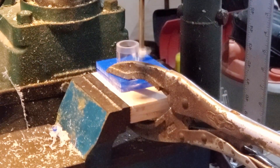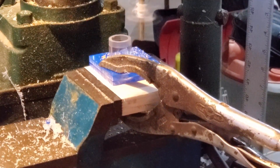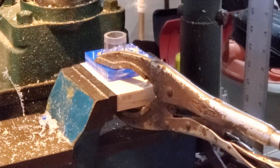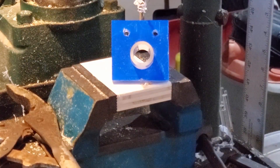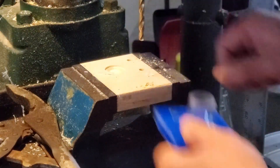To start off, I'm going to drill two quarter-inch holes to hold these two pieces together — this is where the pipe's going to go through. Then I'm going to tap in the rods. I'll cut the rods longer than needed, then use the belt sander to put just a little bevel all around the edge so I can pop them in a lot easier. You can see there's just a slight round to it that makes it simpler.